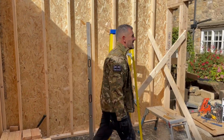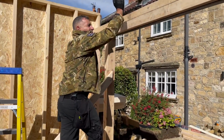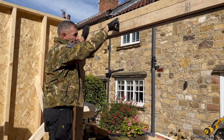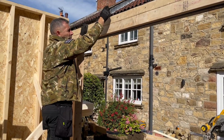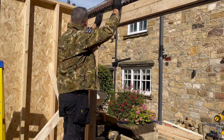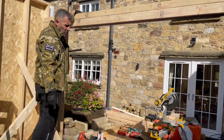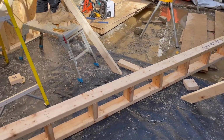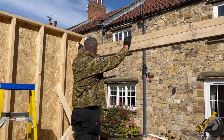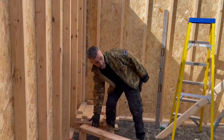Right, so obviously we've got a steel lintel which is going to span the doors. Now what would normally happen, our 5x2s would sit on there. We've tech screwed some 4x2 CLS and we've ripped a piece down as well. We've tech screwed that to the steel. So normally the joist would sit on there, the joist angles would wrap around there and strap the roof to there. But on this occasion we've got extra height, so what we've got is a deficit in the front wall and the side walls. So what we've done, we've created a little ladder stud there. Our 5x2, we're now going to sit that up into place. We're going to fix it through into them, which are then fixed to the steel, and we're also going to fix it to the sides of the building as well. So me and John will get this up now.